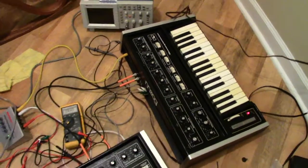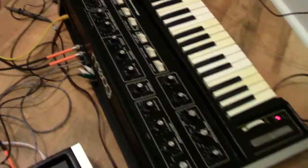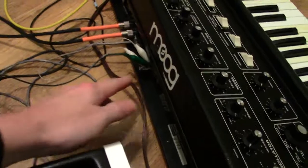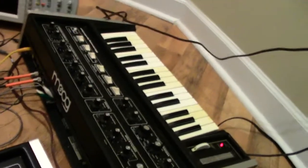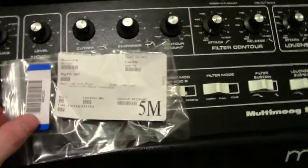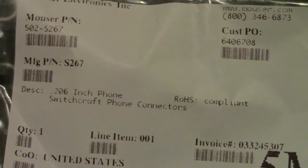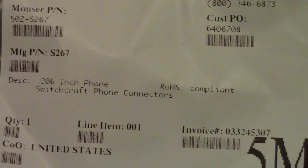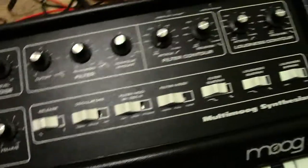Anyway, I'm going to show you something I've been playing with tonight that I don't know if anybody's really experimented with. What I've done is I've got this rigged up right now with gator clips. I'm taking the modulation output — you can actually still get this jack. It's a little smaller than a quarter inch; it's a 0.206 inch phone jack by Switchcraft. These are still available, that's the Mouser part number if anybody's interested. They're not cheap — about $6 parts.